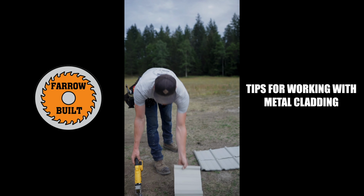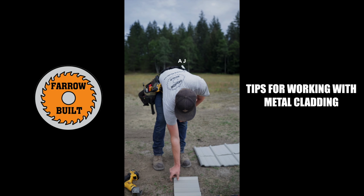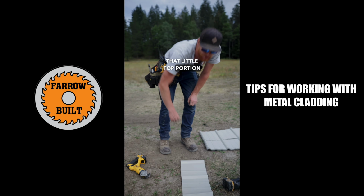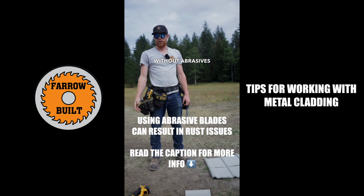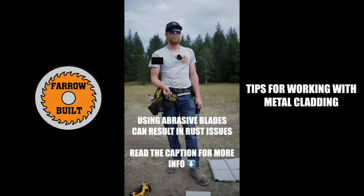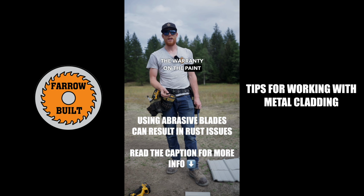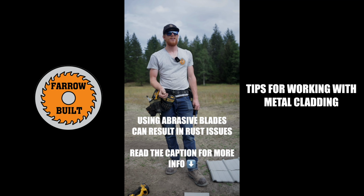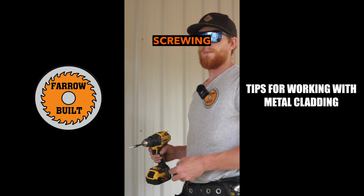Okay, not too bad. It doesn't have to be perfectly straight because we're going to have a J covering up that whole top portion of this sheet. We'll cut all our metal without abrasives, just because the manufacturers we work with will actually void the warranty on the paint of the metal product. Perfect.